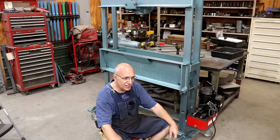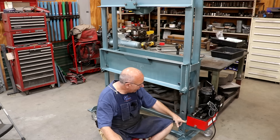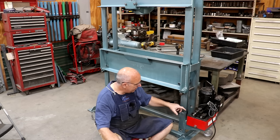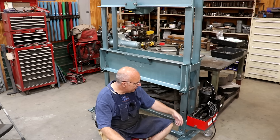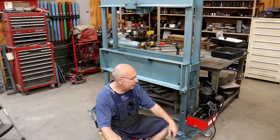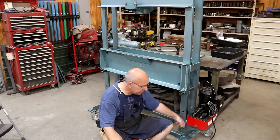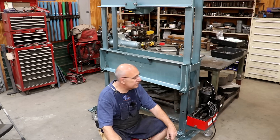How many times has my wife told me I should have listened? Okay, so we're going to come in here, cut this thing off, and I'm going to re-weld it up higher. I think I'm just going to take some angle iron and make a tray that this thing just kind of sits down into - it captures it and just sits in there. If I ever need to disconnect it, you can just pick it up. Gravity will hold it in place just fine. We'll take care of the plumbing a little bit later - right now we just need to get it where it's going to live. I'm going to get in here and zip this thing off and re-weld it. We'll have to touch up our paint when we're done, but that's no big deal.